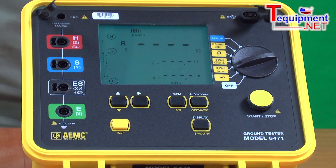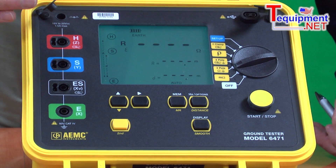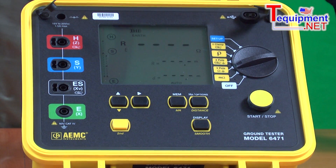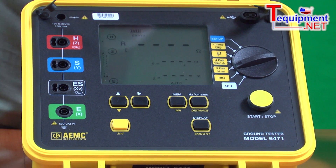When doing a three-pole or a four-pole test, the readings and the distances between the tests are stored in the instrument. The instrument comes with software, which is downloaded through an optical USB port to the computer. That software will plot the soil resistivity plots and plot the ground resistance curve, eliminating the need for manually performing these tests.